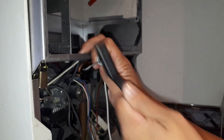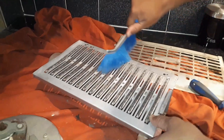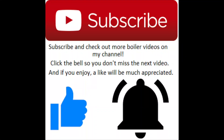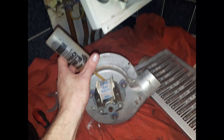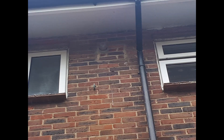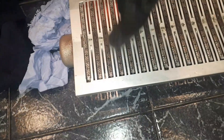Give the electrodes a clean, give the burner a clean with a soft bristle brush, and check the case seal — make sure there are no breakages, it hasn't crumbled away, and it covers the whole outside on all four corners. After cleaning the heat exchanger with a soft bristle brush, give the burner box a hoover out. Oil up the bearings in the fan, check the flue termination, and clean up the fan so there's no dust or debris on it. Hoover out the burner — do check the manual as some burners don't like to be hoovered from one direction.